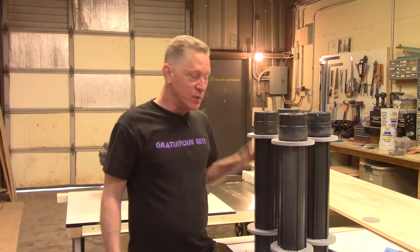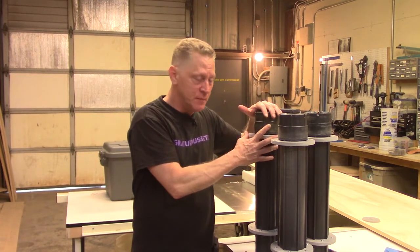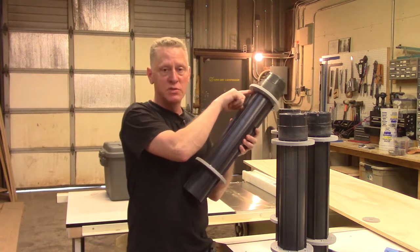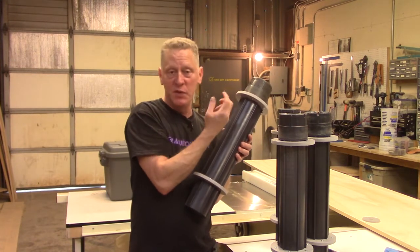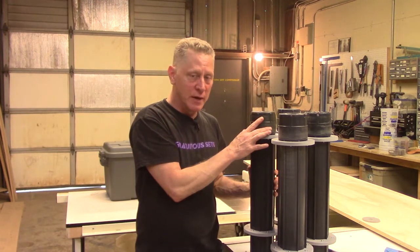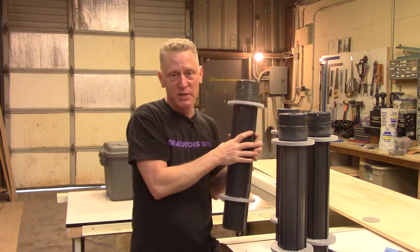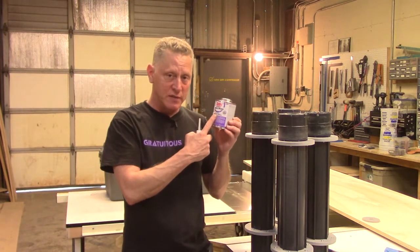The reason is that we're going to use capillary action to do a solvent weld. A solvent weld is where you use, this is PVC as well as this. So both these things are PVC. We're going to use solvent for PVC to melt between the two and have them fuse into one piece of plastic. And you can't fill a gap that way. Also, we're using capillary action to draw the solvent in. If there's a big gap, capillary action doesn't work so well. We're going to use the primer for PVC, which is also a solvent for PVC.